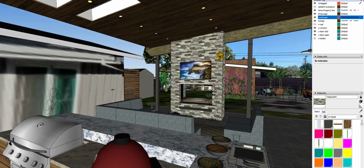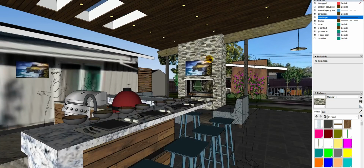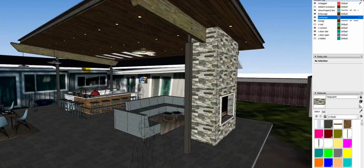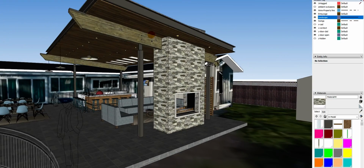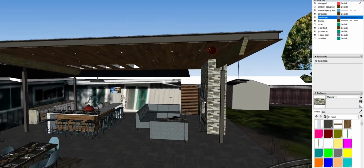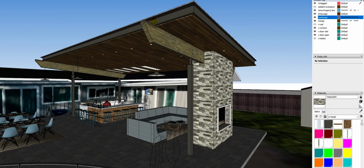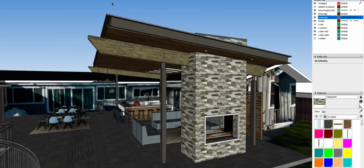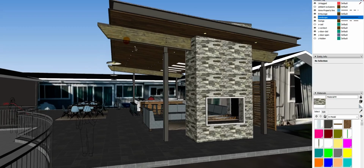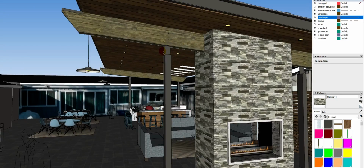It's very busy. Well, get back to me. Let me know what you think about the finishes. But more importantly, let me know if you like the look of this expressed steel. Since the steel's getting put in, unless we want this roof deck to get twice as thick, why not express it rather than capping it with that white trim board that I was showing before? And of course, let me know what you think about this detail here.